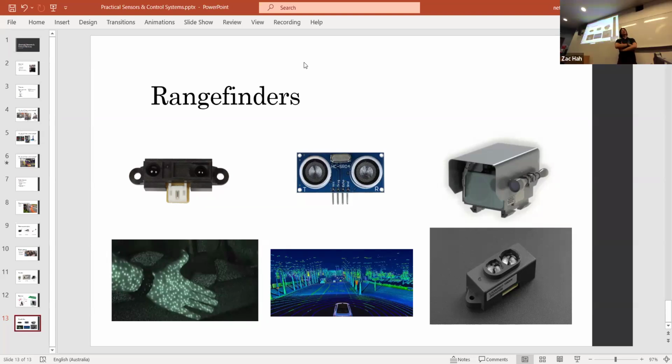Yeah, so there's no reason not to use them as long as you're aware of what the limitations are. With LiDAR, obviously, you have a lot of data that you're handling. The only reason it's not used so much is because of the amount of data that you have to process in real time, and then the robot has to decide what to do with it. Often you'll find that using cameras like Limelight does all of that for you, and you'll get other information like color, as well as distance to things. So this has been less valuable than cameras. When you're driving a car, it's a little bit more valuable because you don't necessarily care what color something is. You just care that you're not going to crash into it. In FRC, it's kind of a different story.